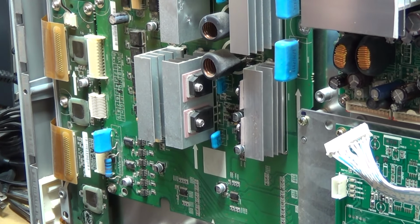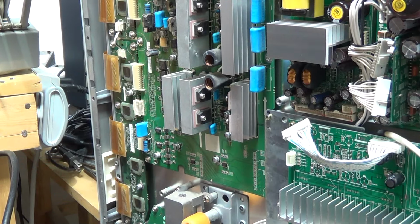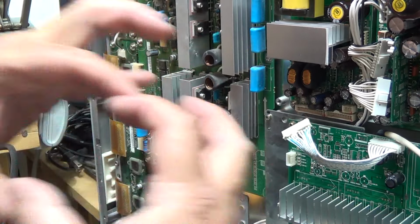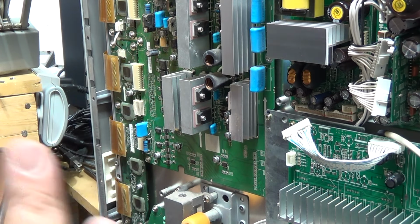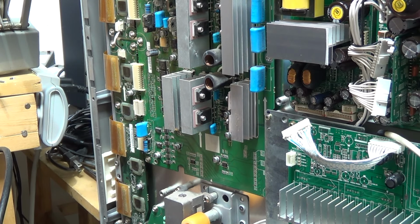One of the things when I was in the electronics business that I really despised was companies such as Technics, Panasonic. When they, in their audio amplifiers, they went to big modular ICs that had everything in the IC. I hated it because the things were so unreliable. They produce so much heat, especially when you get the teenagers cranking the stereo up. They produce so much heat that the module burned out. Panasonic weren't the only ones guilty of it. A lot of the companies did this.